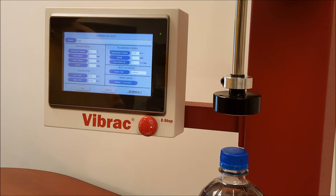Speed is the next option. The machine is made to go between 1 RPM and 5 RPM. It is very important that you do all of your testing at the same speed. Force equals mass times acceleration, and torque is a function of force. If the cap rotates at different speeds, there will be different acceleration applied to the cap in the opening direction. It is very important that you either always leave it on 1 RPM, which is the standard in most industries, or if you do decide to go with a different speed, do all your testing at the same speed.